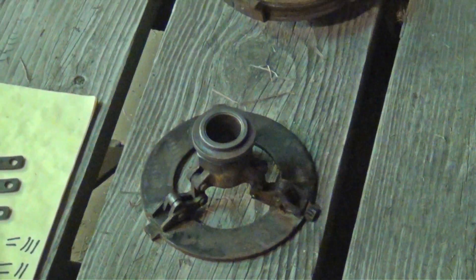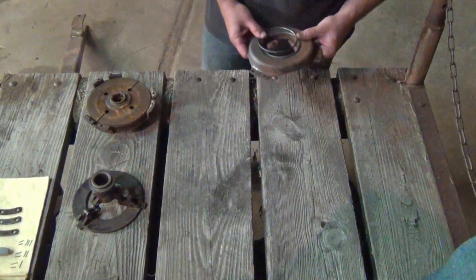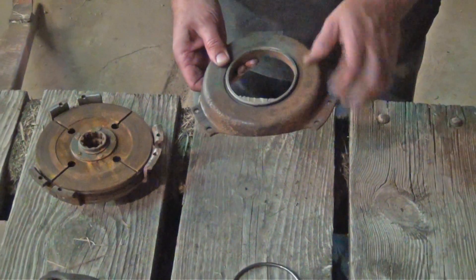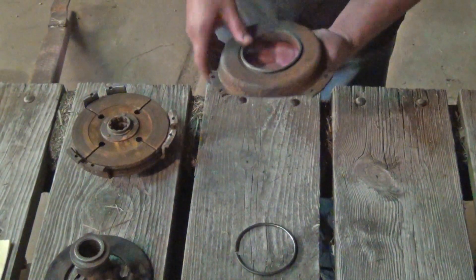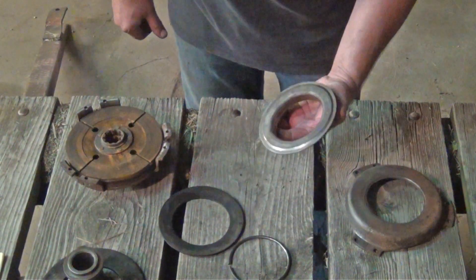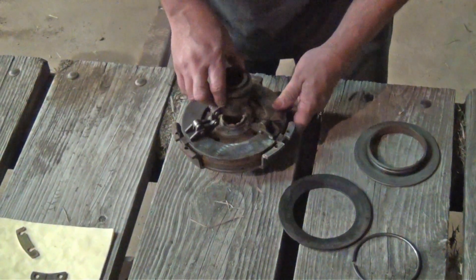In this adjustment process, we had to take out the pressure washer. I've already taken the snap ring off by compressing the pressure washer and walking it out, so it comes apart. You're going to have three pieces: the outer assembly, your pressure washer, and whatever that gizmo is called. I'm going to put it back together, kind of putting everything back together where it originally came apart from.